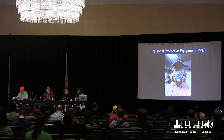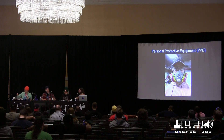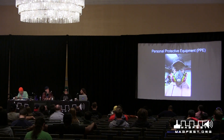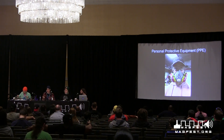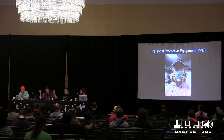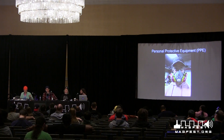So we're going to get down to the build now — fabricating. Let's talk about PPE, personal protective equipment. This is the last set of equipment you need to build an arcade cabinet. Generally whenever you're working with saws or power tools you need eye protection, ear protection, and a respirator if you're doing something that requires that. It's all super cheap and super useful because you need to not go deaf and not go blind. Get yourself safety glasses, ear protection — I have in-ears here, you can also get the big old headphones. I have a respirator on in this photo because I was sanding in a very small room and you don't want to breathe sawdust for hours. They also have disposable dust masks if you don't have a respirator.